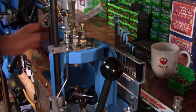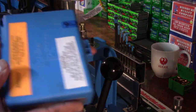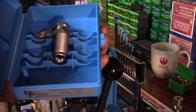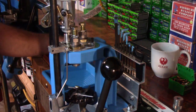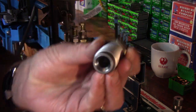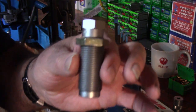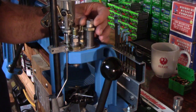We are nearing completion of our dummy round for this video. We need our taper crimp die out of our Dillon die box, so we'll go ahead and open it and there you'll find your taper crimp. First off, keep your dies clean, especially your taper crimp. Make sure your lock ring is threaded upwards to the uppermost portions of those threads, then we're going to come over to position four of our Dillon 550.